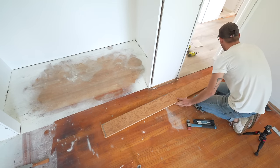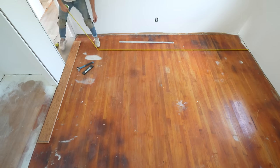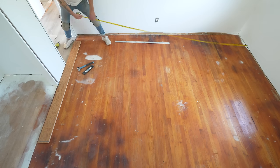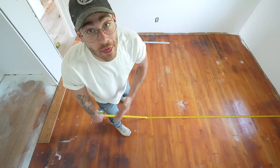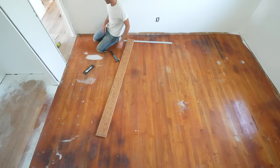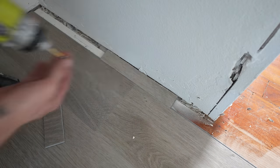I grabbed an eight-foot board with a really straight edge to extend our flooring line, so I could measure from all four corners and make sure it was square. I've got 145 minus an eighth, and 145 minus a sixteenth — I'm going to give the back of this straight edge a little love tap and call that good, because there could be enough deflection in the drywall to account for that small difference in measurement.